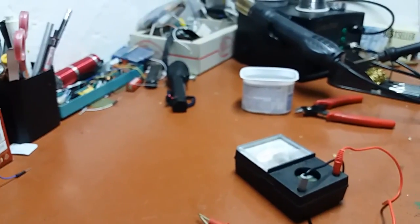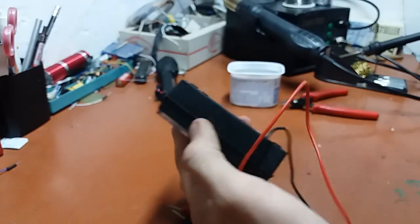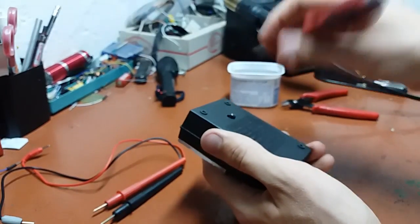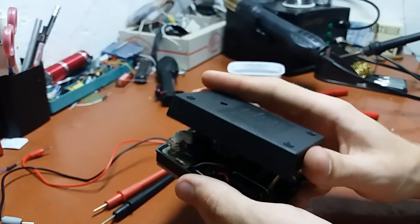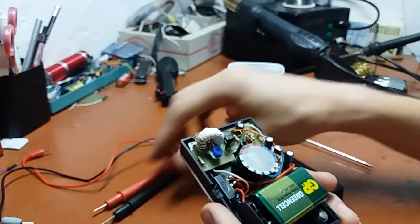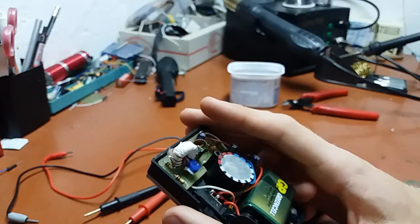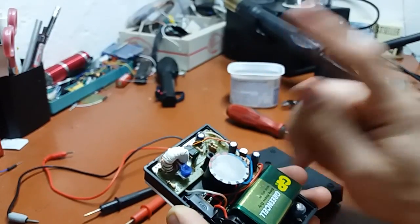You may ask how. Well, I was looking for bad capacitors in an LCD monitor, and being the idiot I am, I assumed that the bulk capacitor in the switch mode power supply in that monitor was discharged by then — and it wasn't. The moment I connected the second probe to the capacitor, I heard something pop inside. I then understood: that capacitor was still charged. Moral of the story: do not assume in electronics — always measure.